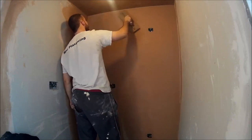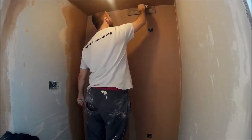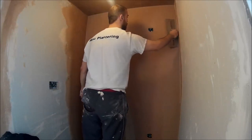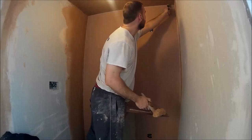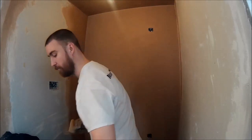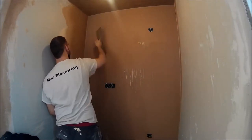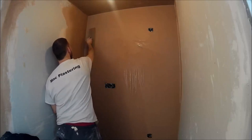Same routine as before: clean your angle and start exactly where you started the first time, which for me is always top left. Work along the top, then bottom left along the bottom. This is important — taking away the water. If you leave water marks as you trowel, you'll get dirty water marks. If you leave them all the way through, they can pick up poorly on the paint job and will not look nice, potentially looking like tiger stripes.